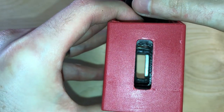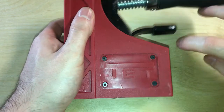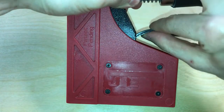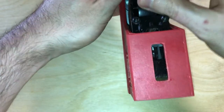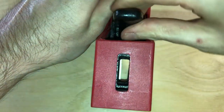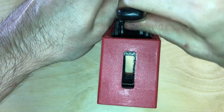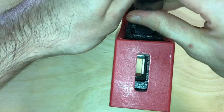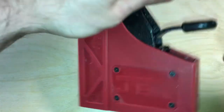A lot of the very few tips I saw on the internet talked about fiddling with the handle, but what I realized is that this lever doesn't just pivot up and down — it also kind of translates, it actually slides up and down. If you push it up and down rather than just pivoting it, you can see what's happening inside the holes: a rectangular piece comes up from the bottom and narrows the opening. That was the problem on all the clamps I couldn't convert — this lever was in the up position, closing that opening so that as the bar tried to fish through from behind, it was getting hung up. All I needed to do was push the lever down to open up that opening.